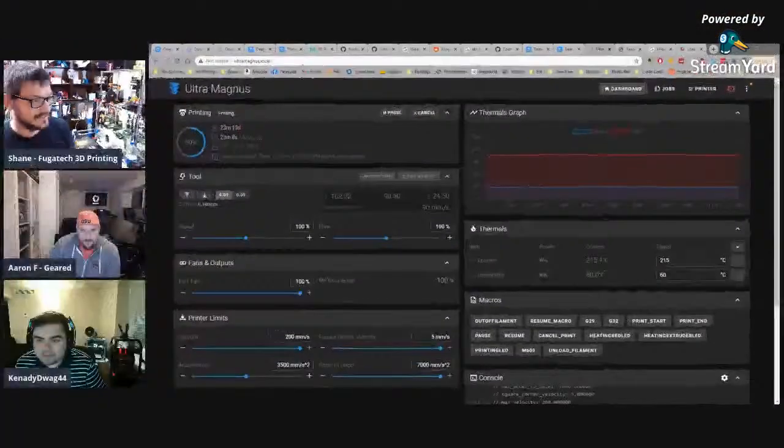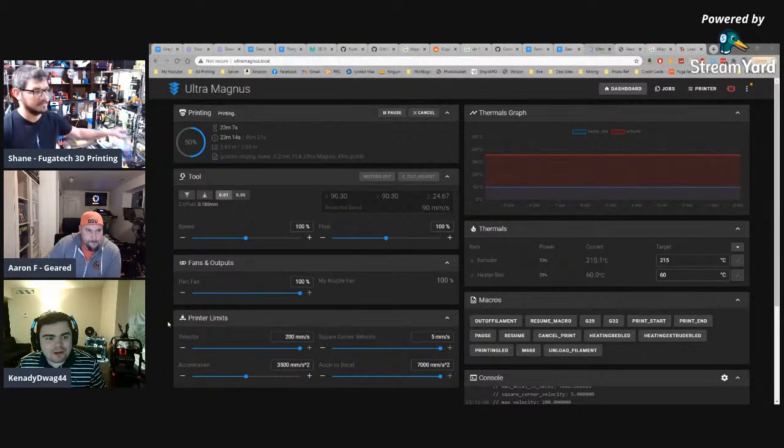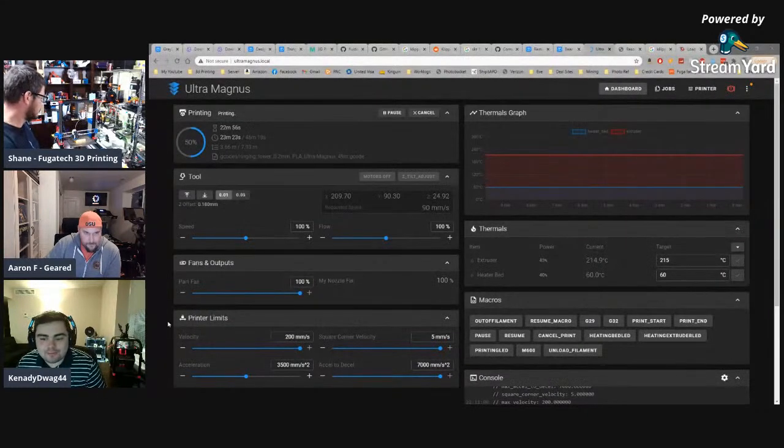Yeah, it looks like you're at about 2,500 Hz right there. See what it says here. We're at 3,500 now. Oh, okay. That's right, it tells you. Nice. Yeah, that's one of the really nice things I like. Like, remember trying to tune linear advance on your BLV and how you had to do that one layer really hard to get to stick test pattern? Yeah.